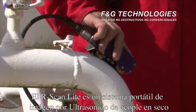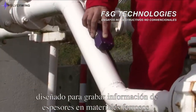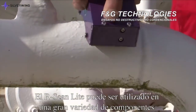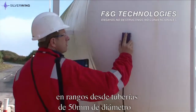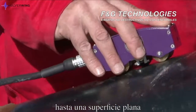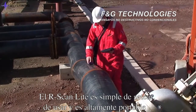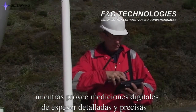The R-scan Light is a portable, dry-coupled, ultrasonic B-scan imaging system designed to record thickness information on ferrous materials. The R-scan Light can be used on a wide variety of components ranging from 50mm diameter pipe up to a flat surface. The R-scan Light is simple to set up and use and highly portable while providing detailed and accurate thickness information.